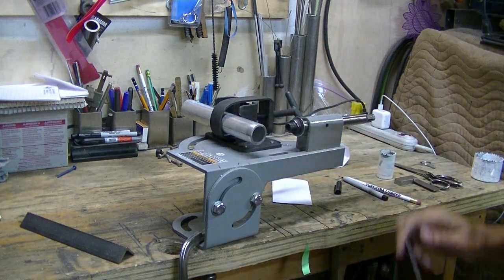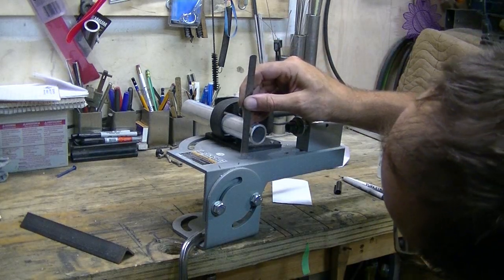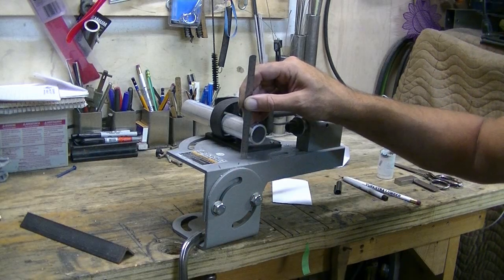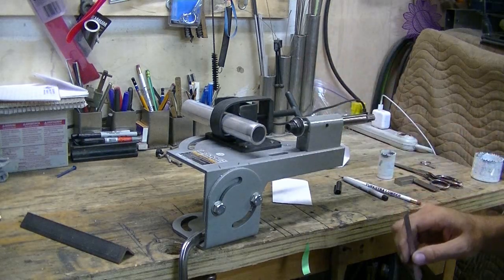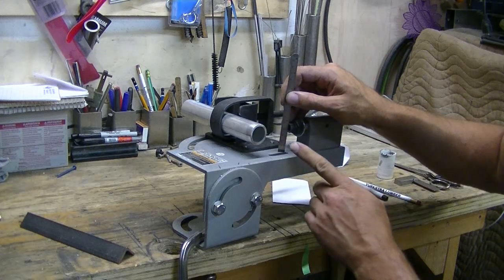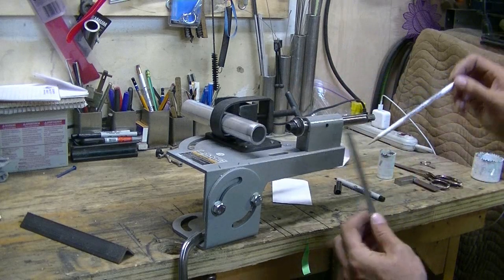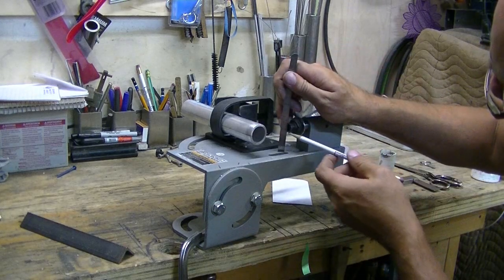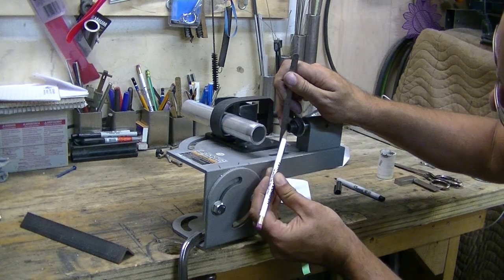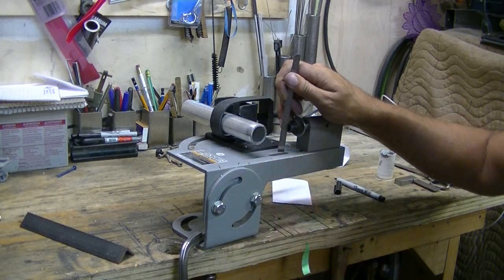So we're extremely close, good enough, and when I measure the height of our centerline mark, I'm getting 1/16 under an inch and a half. So that's going to be 1 7/16. And then if we just eyeball the arbor, we can see that it's not very close. So here's my mark that is center on the tubing. 1 7/16, and we're at least a good 1/8 or so, maybe 3/16 off. Maybe I'll zoom you in for that.